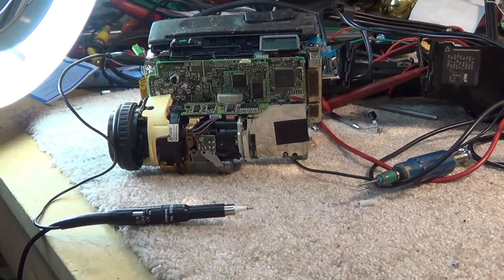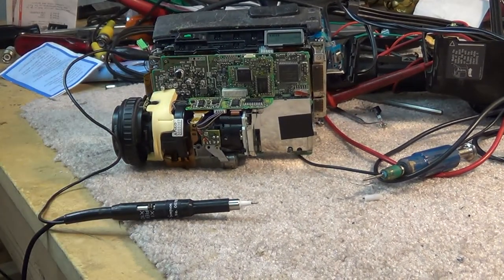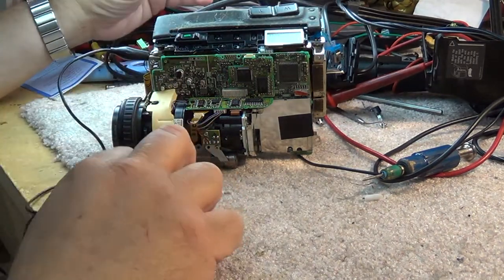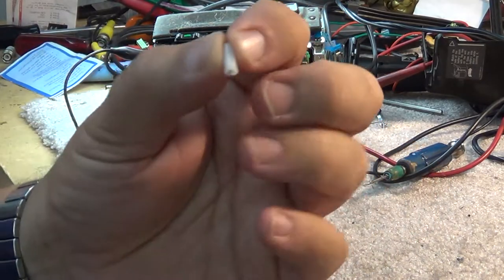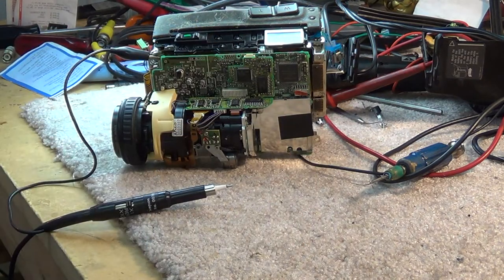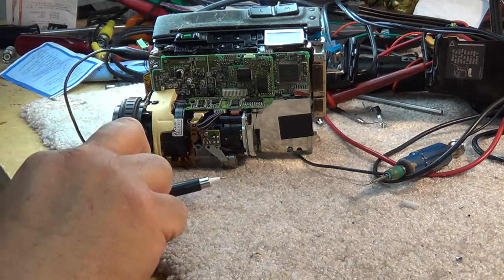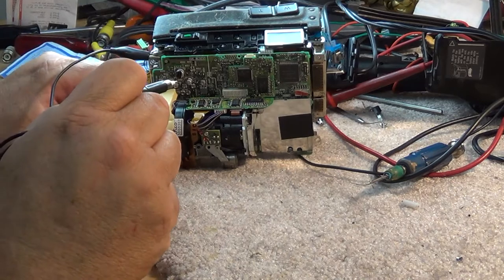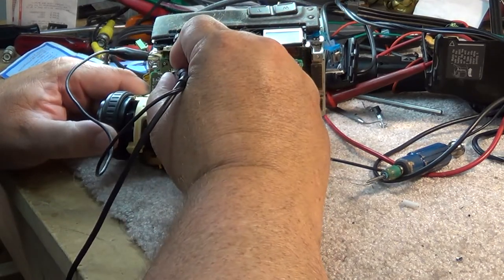We're putting the camera back together. Actually, looking more carefully at the SR block, it's one of these filters in here - we have no sync. The reason the tape isn't playing back is because one of the guideposts has fallen out of the mechanism. That has to be put back in. The reason we don't have a picture from the camera is a bad filter capacitor in the sync circuit - more than likely this one right here.